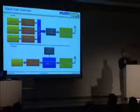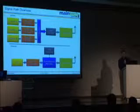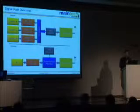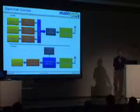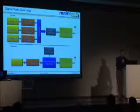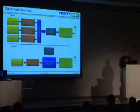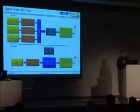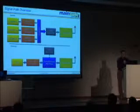The next step is the multiplexer, which has to combine all the streams coming in from the different encoders and make them form a DVB stream composed of several programs. So the idea behind DVB is better use of the channel bandwidth compared to the old analog TV system. This is done by using the same frequency bandwidth and putting more streams into that one channel. For that, we need a multiplexer.